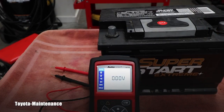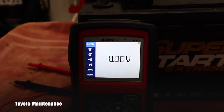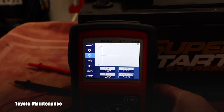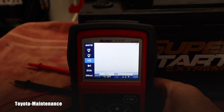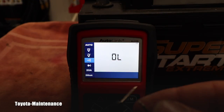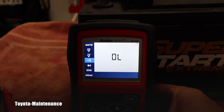What's nice is that this has automatic ranging, which normally is only on better voltmeters. On cheaper ones you have to select the range manually with a switch, but this one does it automatically — this is wonderful. That was DC voltage. You can scroll down to DC voltage, then AC voltage, then continuity test. Right now it shows open circuit — if I touch the probes together, it shows zero impedance and even gives an audible beep. This is absolutely incredible, I love it.